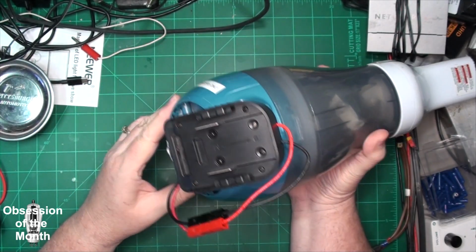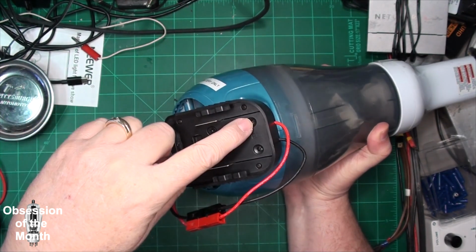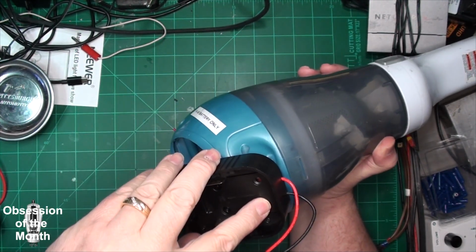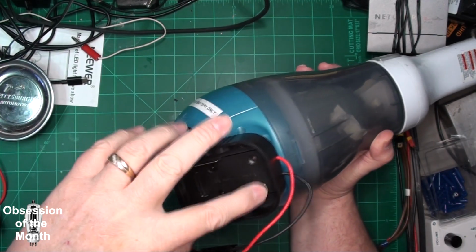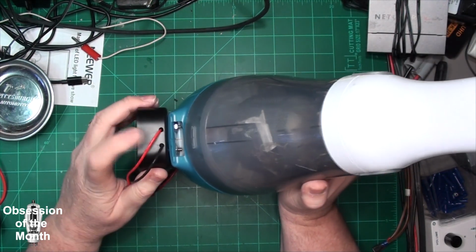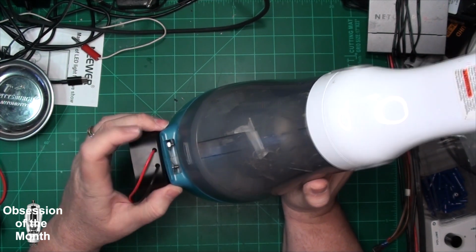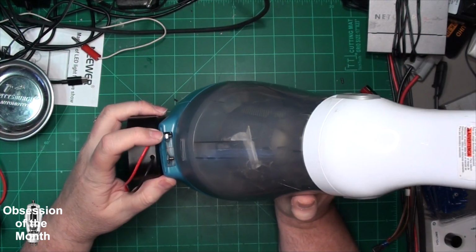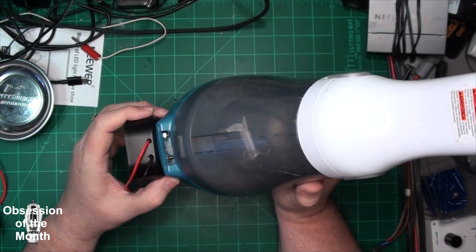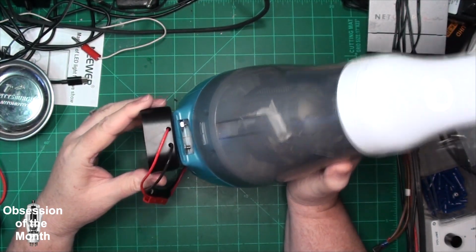The way I did this was I removed these 4 screws, popped this out. I had marked the holes and drilled them, and there are 2 screws in here. There are no electrical contacts in this area. Then I drilled holes through this. This is where you would hang the unit up, and I don't have the bracket and don't really care. I used two, I think 8-32 screws, and some nuts with Loctite, just to make sure it didn't vibrate off.